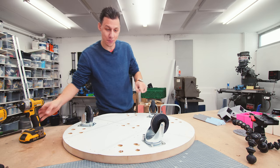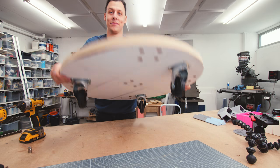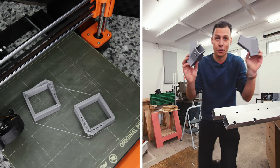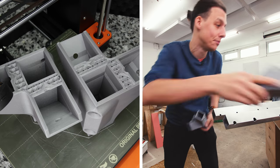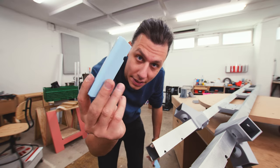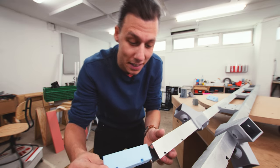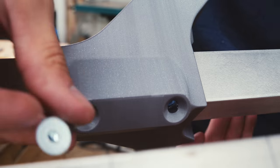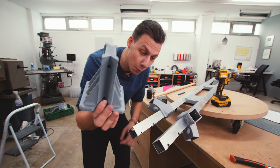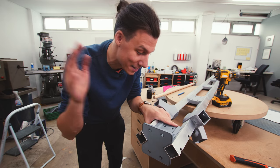The base is cut out, I've drilled a whole bunch of holes, and I've attached a couple of wheels. Now we're going to continue with our big aluminum piece - I've 3D printed a couple of big Y-joints that are going to slip right onto the bottom of these tubes. I've also printed some triangle pieces with nuts that go into the hex holes in the back, aligning with the holes in the Y-joints.